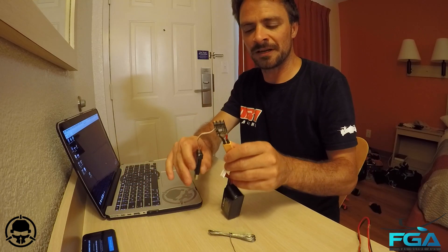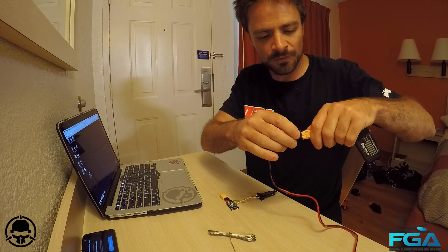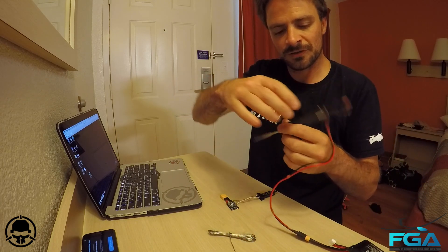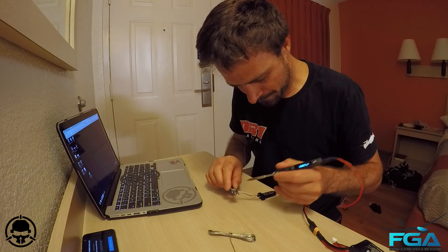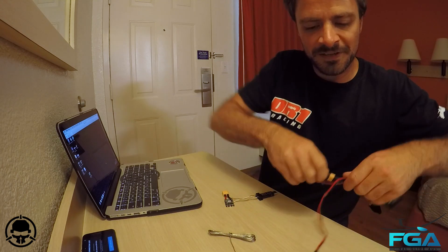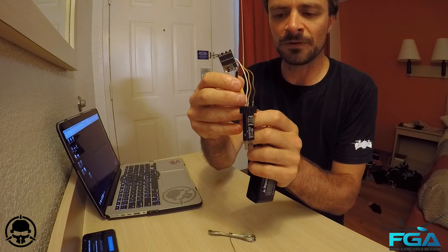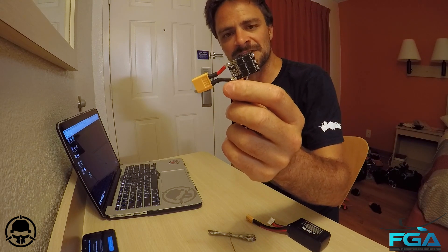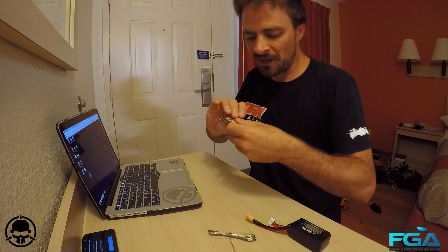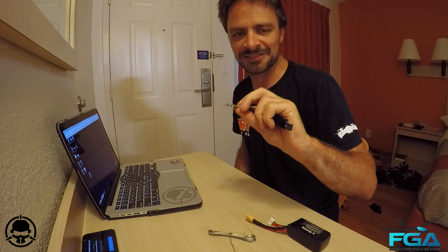It's verifying the download — and it's all done. That's flashing the firmware complete. Now you do want to unbridge the bootloader pads — if you don't unbridge them, it is not going to work. With the bootloader pads unbridged, the easiest test is to plug in the power again. If you've unbridged successfully, the blue light will come on — and there we go — and go back off again. That's all perfectly normal. Remove the wires and that ESC has been flashed with 1.02 and is ready to go. One other thing I like to do is use a white marker pen to write over the original sticker or put a white dot on there so you know all your ESCs are the same version.